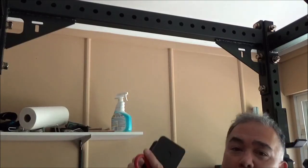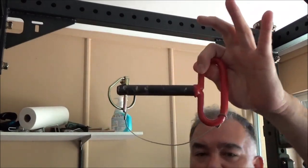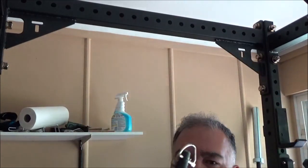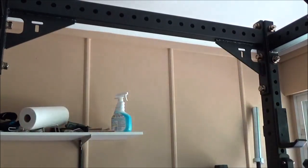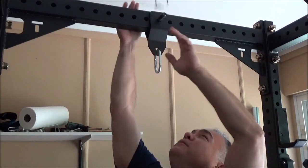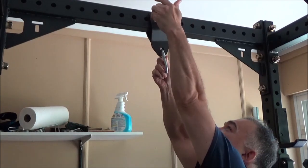So here we've got the bar. This is my shackle that came from Titan — again, it comes with a bolt, but I'm going to use this hitch pin handle instead. You can use one from the monolith attachments from Titan or go to Tractor Supply and buy four-inch hitch pins. I'll undo the cotter pin, put the red handle through — boom, there we go, it's in. Clip this in and now it's on.